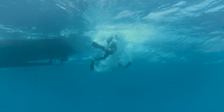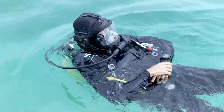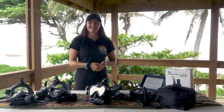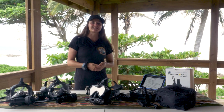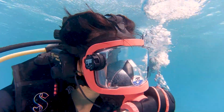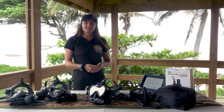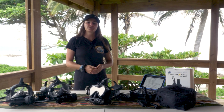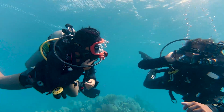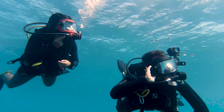When you enter the water, the boot up menu will be heard when the unit is activated by the water switch. Once you're settled in, practice accessing the menu and changing the settings. Ensure the buddy phone is centered over your ear. Make sure the volume is set to a level that will work best for you. You can adjust the buddy phone back off your ear a bit to reduce the volume as well. Practice your communications. The more you use the equipment, the better you will get.